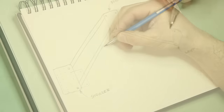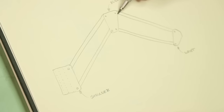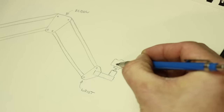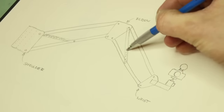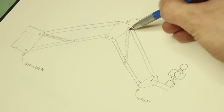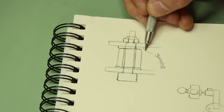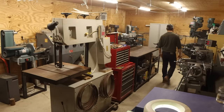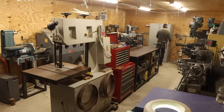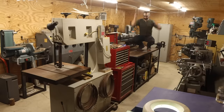Only much larger and much more robust to hold my somewhat beefy camera. It will have a central pivot at the base — I'll call this the shoulder. Then two pairs of arm tubes that sandwich between plates at the elbow and wrist. A simple bar at the end will let me mount an articulating ball head for the camera. And a series of tension springs will help balance the weight of the camera and the arm itself. I'll also include nylon bushings at all the pivot joints.